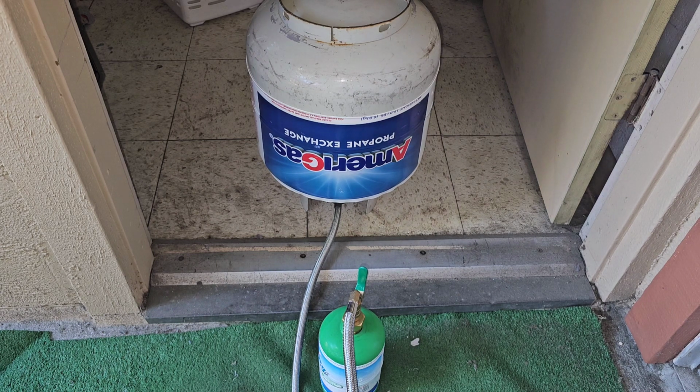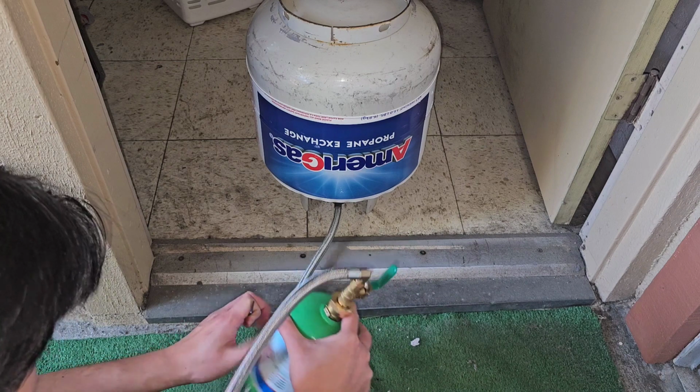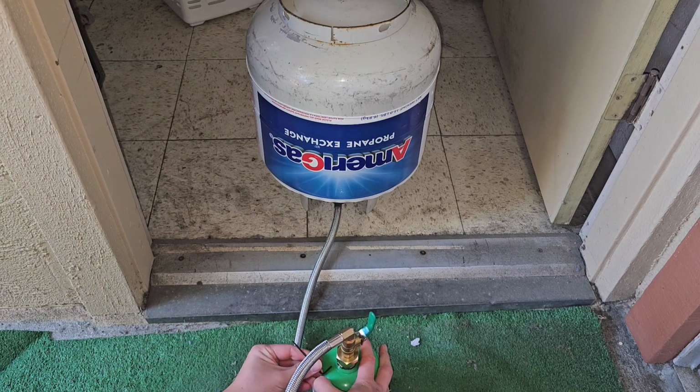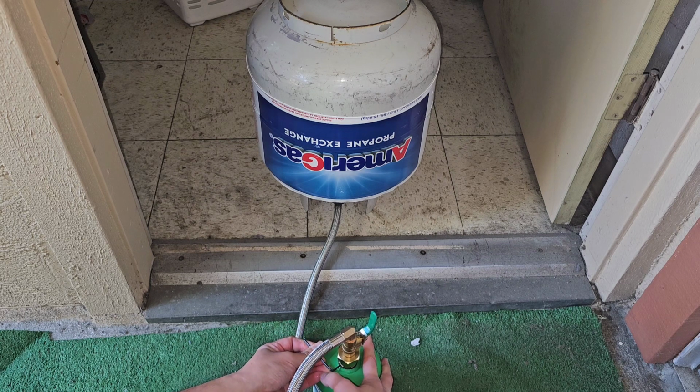Let me go grab the Allen wrench real quick. All right, so I don't hear it flowing anymore. So what we're gonna do is open up the valve here, okay? So just get the little hex key Allen wrench that it included, and we're gonna turn it counterclockwise. You can hear it leaking out air. Okay, and let it bleed out a little bit. It says to kind of let it go till liquid starts shooting out.